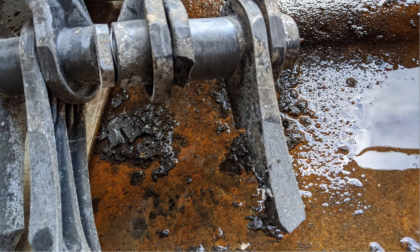However, the continual operation and high torque condition of these clarifiers still require long-term maintenance procedures that can lead to catastrophic failure if not followed. For example, this broken chain not only shows an unplanned crash, but its flat spots also indicate abrasive degradation on areas that should not be showing wear if proper maintenance practices are followed.